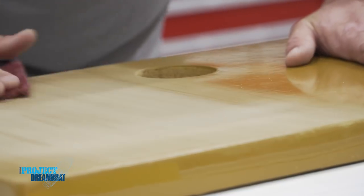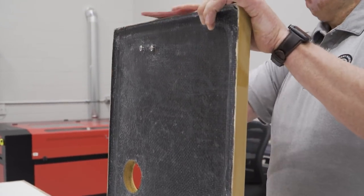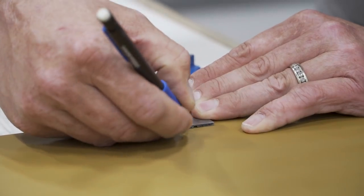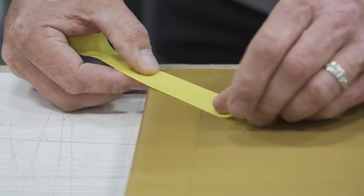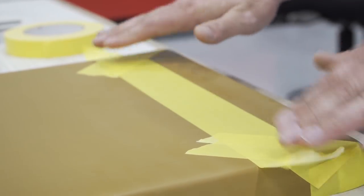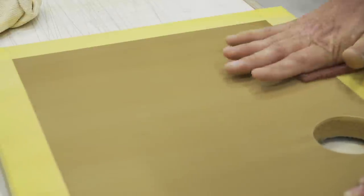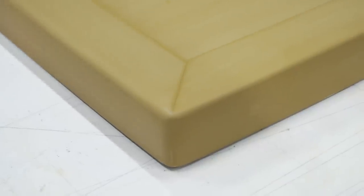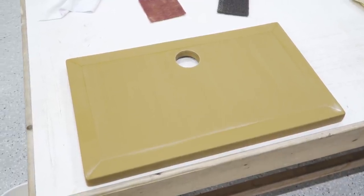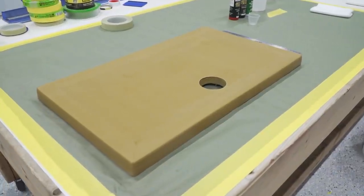For added pressure, I'm going to be filmed doing it for the first time. An important part of getting the wood to look realistic is the preparation of the base coat. Before I start laying down the faux process, I needed to sand the panel in individual planks - almost individual pieces of wood. So I tape the panel off, then take a rough scourer and scour lines in the direction that wood would actually run. The first thing I did was the border, but it had to be made out of individual sections, because that's how a real wooden panel would be made.